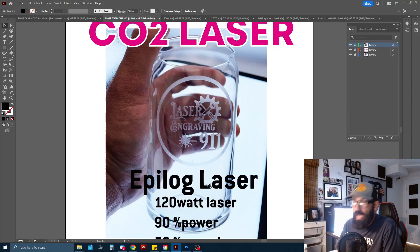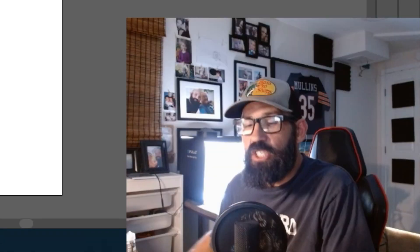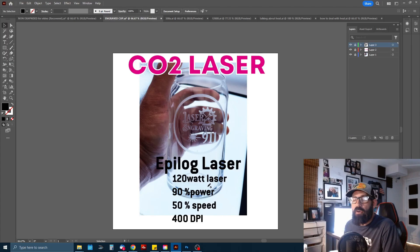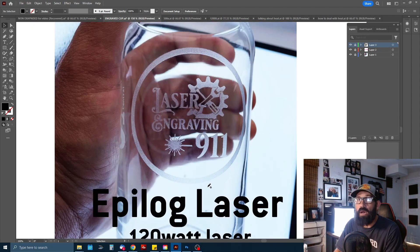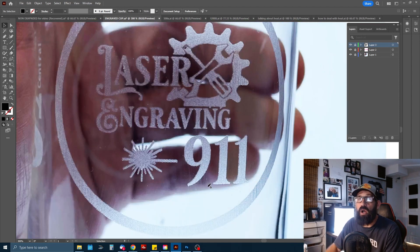It's not just about settings — it's also about the type of glass you pick. A good rule of thumb is that the cheaper the glass, the better it engraves. Higher-end glasses like wine glasses have a higher lead content, and the engraving can be flaky. It cannot engrave with such a nice frosting like the one you see here.